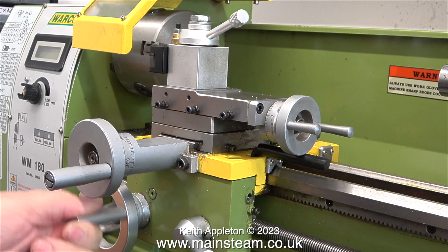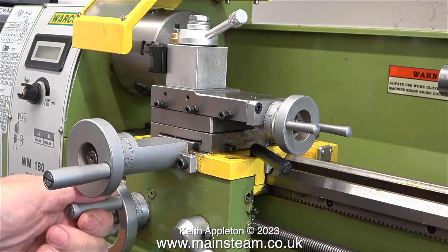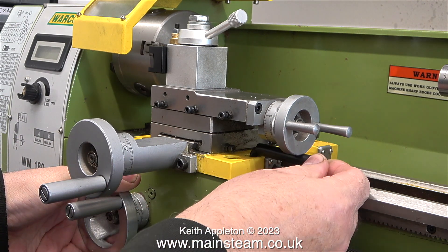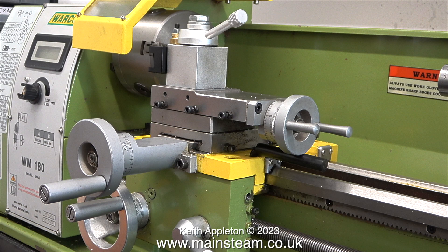When it's parallel with the bed it is not clamping, and the saddle moves freely. It only tightens up when I pull it towards me. Although there is a bit of serendipity — happy accidents — going on here. First of all, the Allen key fits into the Allen head bolt in the perfect position that I want it to be in. And then the silicone rubber just touches the hand wheel of the top slide. And that, my friends, is how I made a saddle clamp for my Warco lathe. Stay safe, stay healthy. Thanks for watching, and I hope you found it useful.